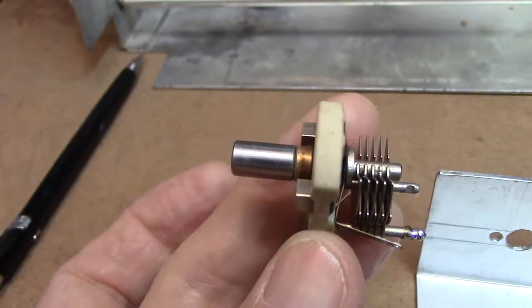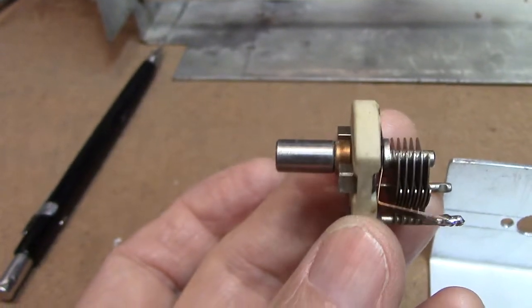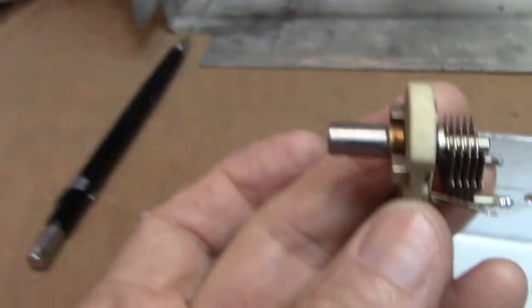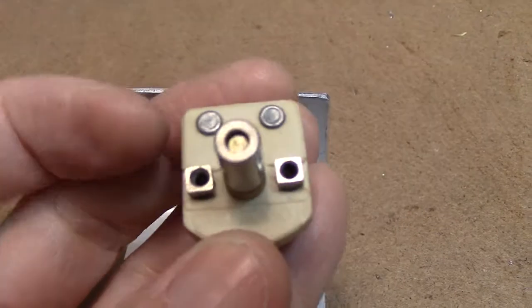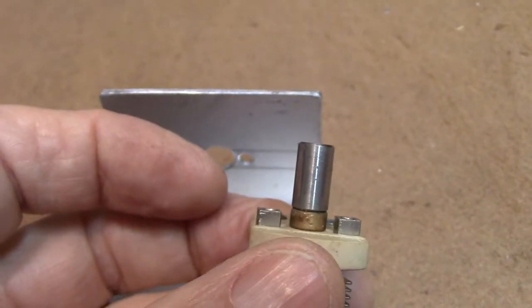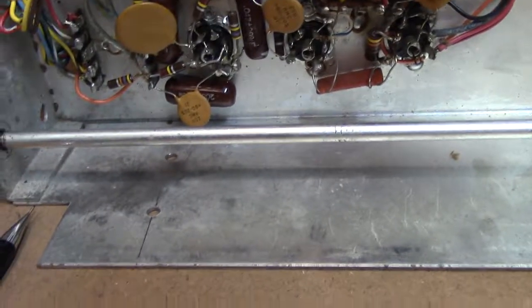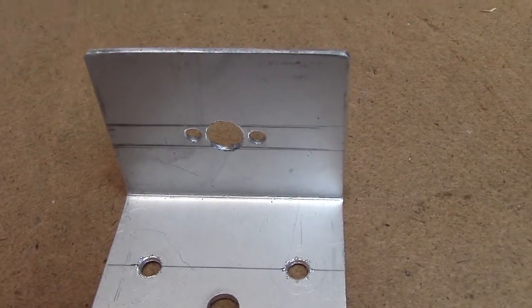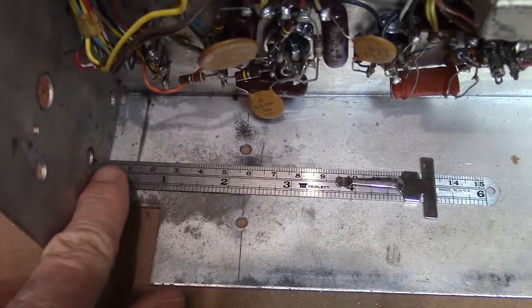The middle hole has to be bigger than the shaft. Notice how short that shaft is — if you mounted it on the front panel it would never stick out far enough to put the knob on it. I have made extensions using quarter-inch bolts, nuts, a drill press, and brazing tools, and it's possible to do that — but this bracket solution is better. Drill the middle hole, decide where to drill the mounting holes, and then you can mount it.